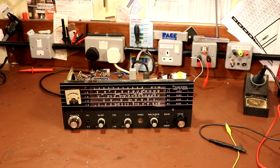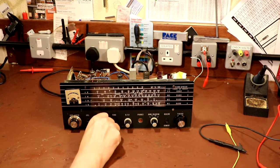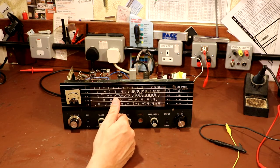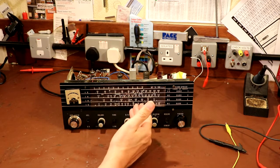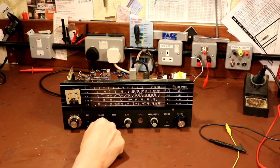Let's switch the power on. Okay, so as you can see we've got mains hum. Because I'm used to working on radios, I can tell by the tone of that interference - that's 50 hertz, that's the frequency - 50 hertz, so that's the incoming mains. Now the reason I mention that is because this radio has been implemented with a full wave rectifier. If this hum was coming from the smoothing capacitors - and of course everybody says you need to change out the main smoothing capacitors - well that isn't the case. If it was a ripple problem with the smoothing capacitors, the frequency of the hum would be at 100 hertz. But it isn't - it's 50 hertz - so this is direct pickup of the mains.